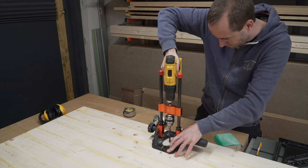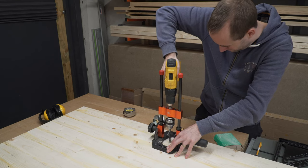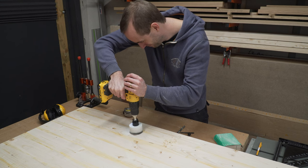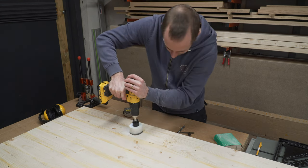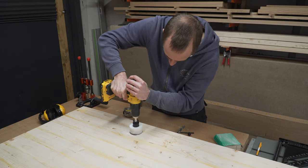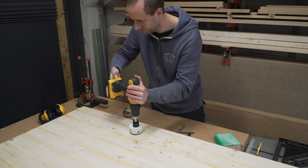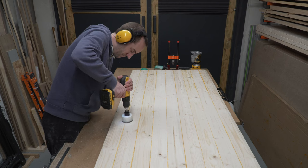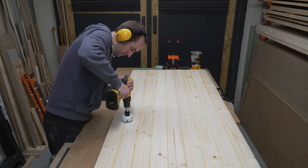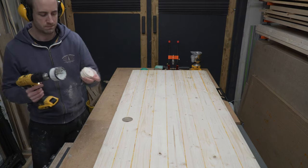We like a tidy desk so we decided to drill two additional holes into our desktop: a 20 mil hole for a monitor stand and another 70 mil hole for our cable port. After drilling the pilot hole we started drilling with the hole saw — remember to check your batteries, as I think poor Michael had a bit of a rough time getting that hole saw through with some less than fully charged batteries. We also ran the router round with a chamfer bit to neaten up the edges on the top and the bottom.